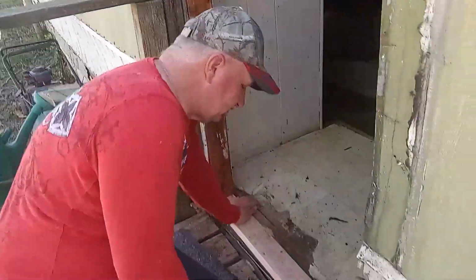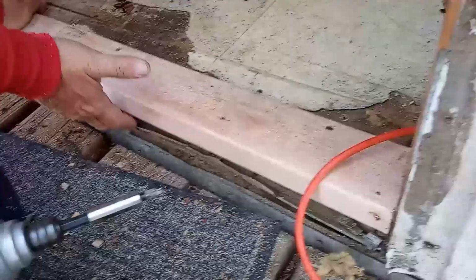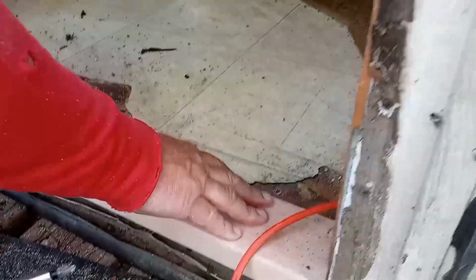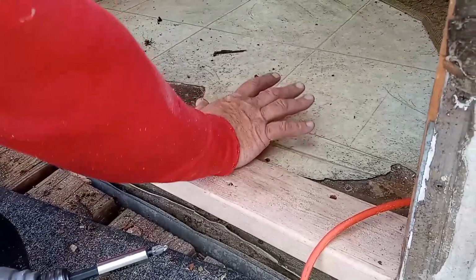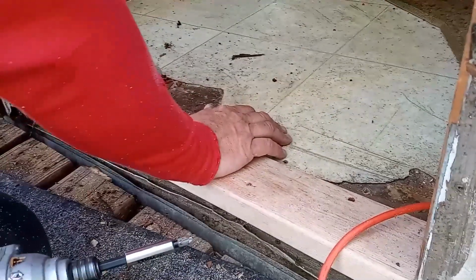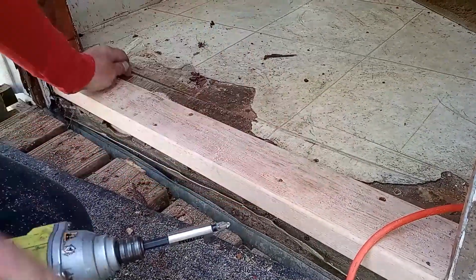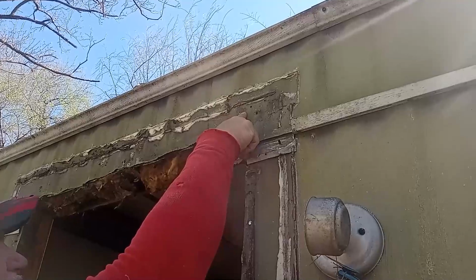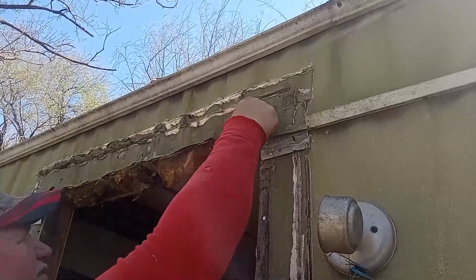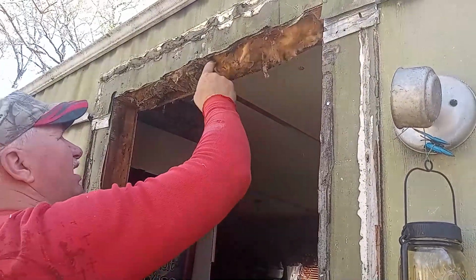All right, I guess you weren't here to see, but we put 2x sticking out here. We put another 2x here. Then I put this one to get it higher than the floor so it quit dragging on the overlaid floor. They put plywood over the resistant plywood, so that way we won't be dragging. Then we've got to cut the opening so that the new door will fit, which goes up to 82 inches up here, gives us room. So next I will mark on the inside the same thing. We got to cut these 2x off.